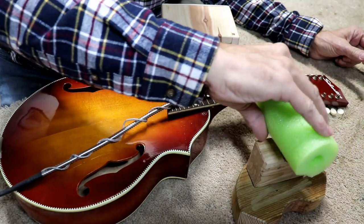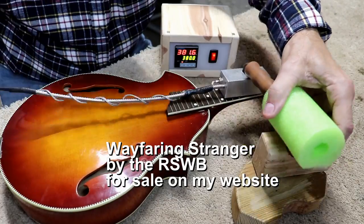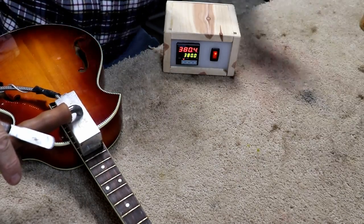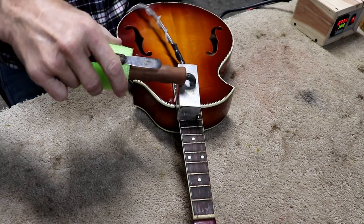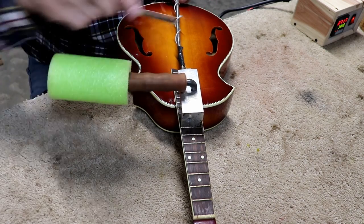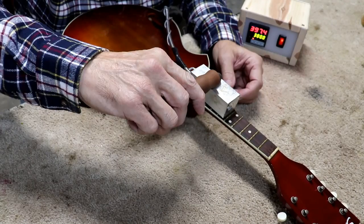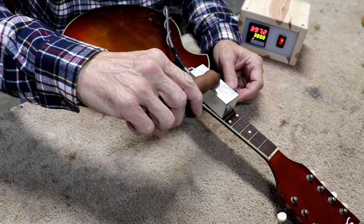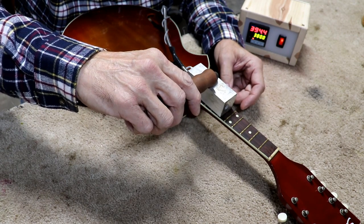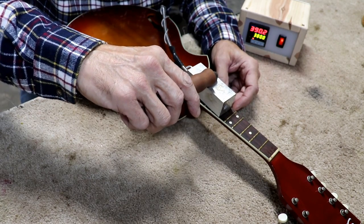It's a little early but I was expecting a little more than what I got on my first attempt - I wanted it to feel like it was just going to come loose and it didn't. I'm not sure what glue they used on this but it sure isn't an easy unglue. I've taken many fretboards off that I've glued with Titebond and I don't have this much trouble at all. Hide glue sometimes is not that easy to get loose with heat - it's kind of crazy how that works.